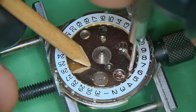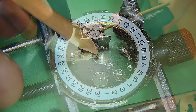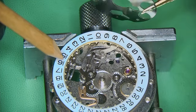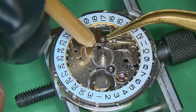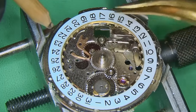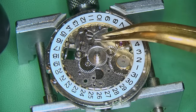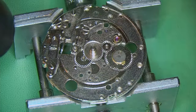I've turned the movement over and now we're going to tackle the dial side. There is a bridge plate holding the calendar mechanisms in place, held in with three screws. I'm using a piece of pegwood to hold it down so I can lift it up gently, because I know there will be a spring underneath — the last thing you want is for that to fly across the room. Quick observation of where everything lives, then I can start to dismantle it. There's a date lever being removed and I've also removed the spring from it. Last but not least, I can remove the date disk.